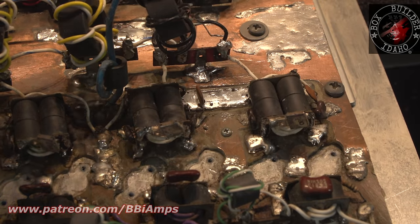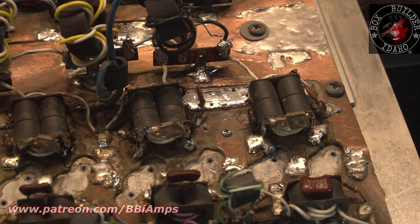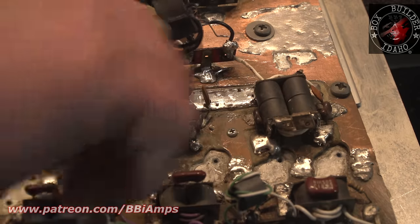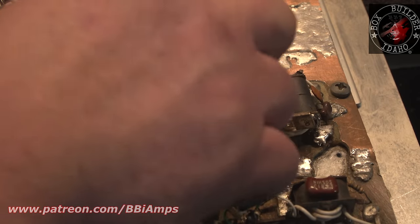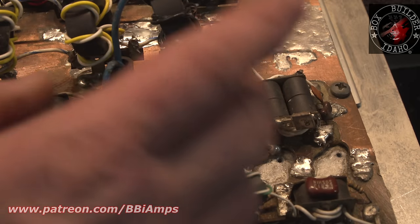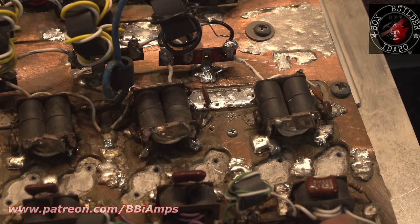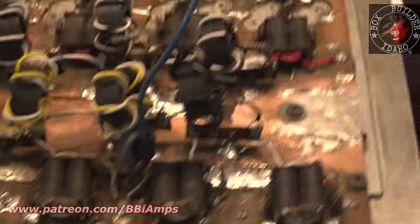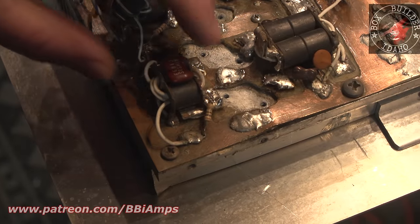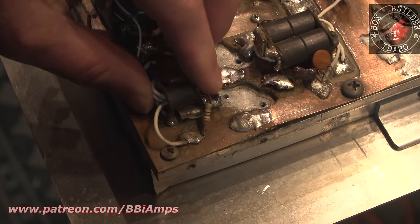The problem is the backside of the transformer has been completely blown off, it looks like at least twice, and is being held down by some Teflon wire they've stripped off, and they've got it soldered to the back of the transformer, and then another big piece of braid underneath that trying to marry the transformer. The traces are all scrubbed off. This transformer here, this gets even better, yo. Let's look at this. This transformer here is held down by a separate piece of phenolic and double-sided stick tape.